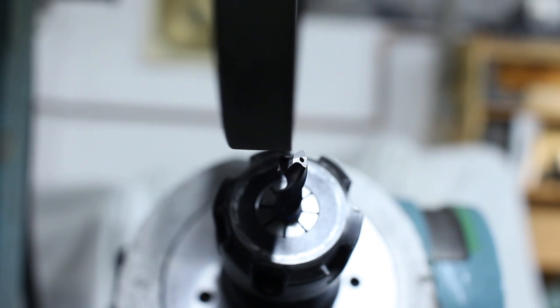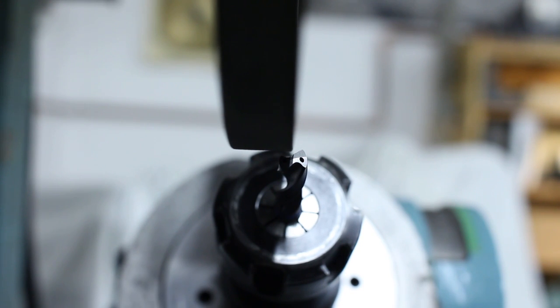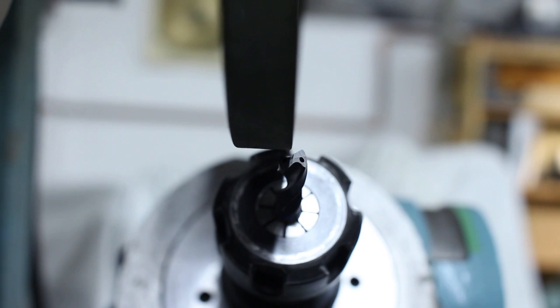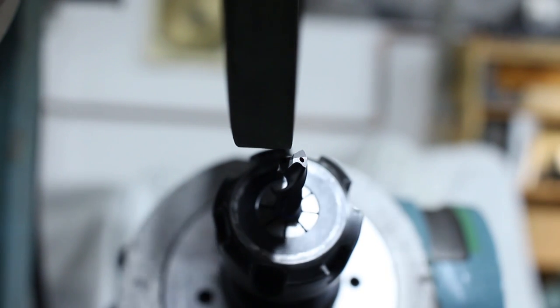We're moving the table of the grinder now towards the grinding wheel, and I'm just eyeballing the center of the drill now. And I should probably set a table stop so I do not run into the collet chuck. There we go. That's good. And probably a second stop so I don't run into my camera, which would also be quite tragic. There we go. Okay. Travel is limited.